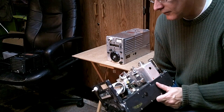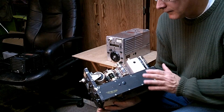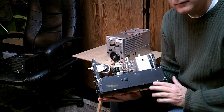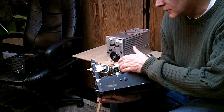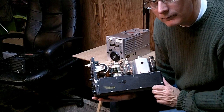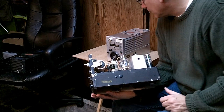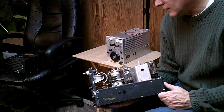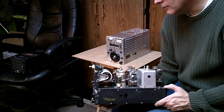The pinout is not identical. The other interesting thing is, in the Navy version they use a choke and capacitor coupling to the output tank, so the tank is actually cold to the B+. In the 274 version, the tank is hot with B+. So that's an interesting variation between the two sets.